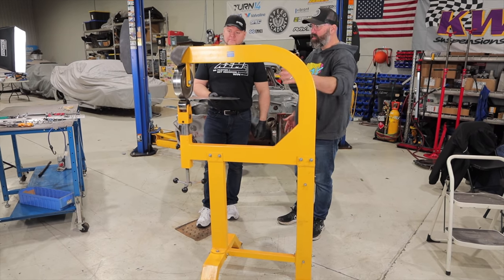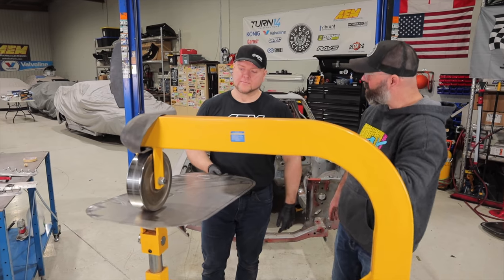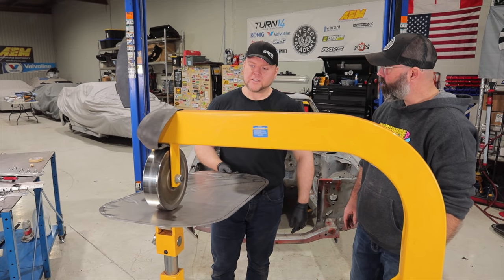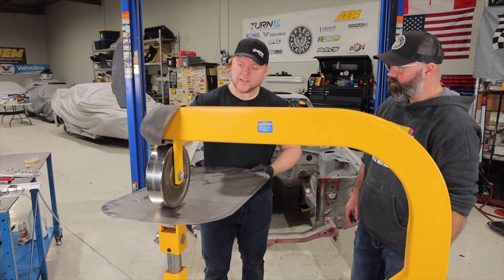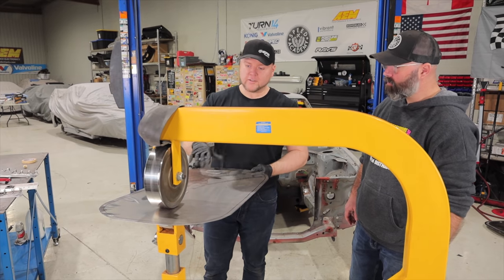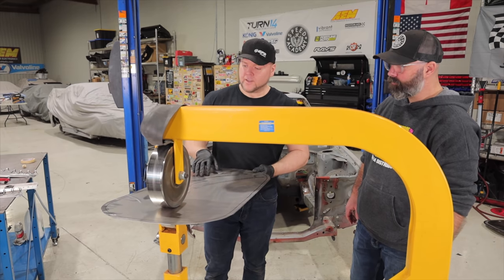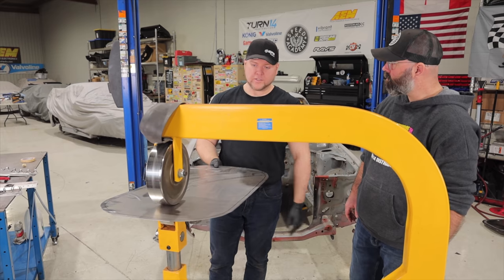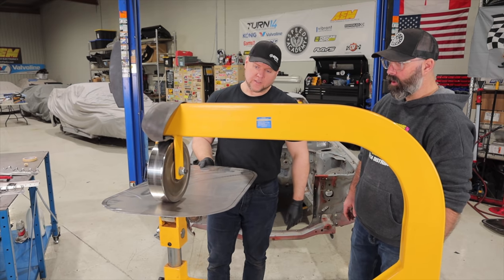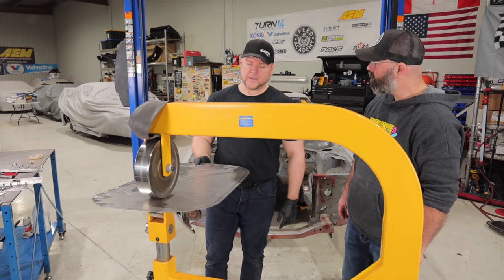So this is a device used to put a subtle curve into metal, I suppose. At the base of it, all it does is stretch metal. So when you're stretching the inside and you're leaving the outside untouched, it has to go somewhere. That's when you get that curve coming in. If you roll all the way to the edge, then you get more of a consistent shape. So basically, it's a way to smooth out bumps and also to give a panel some shape.